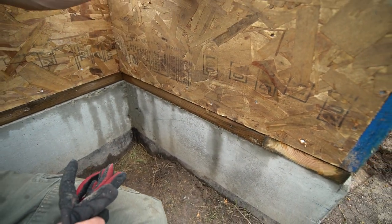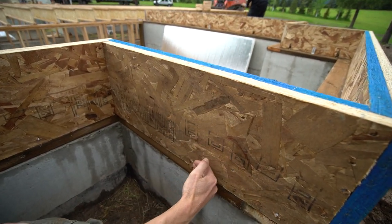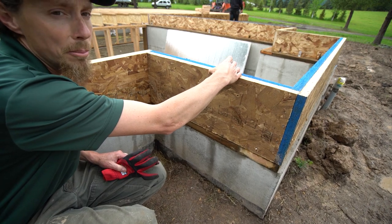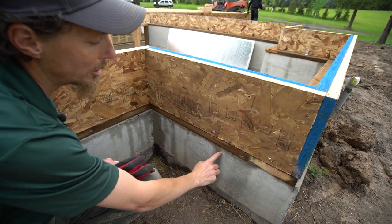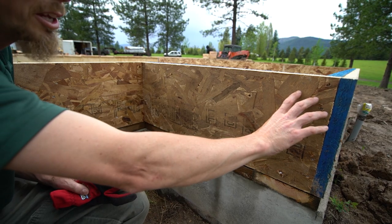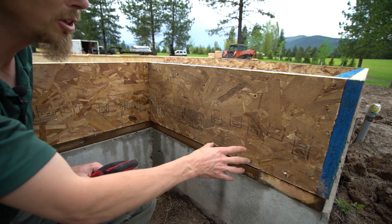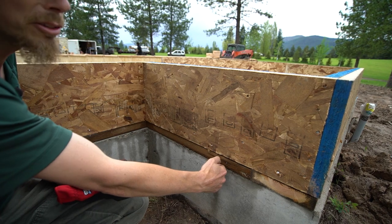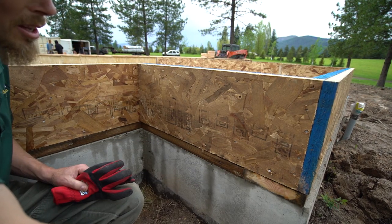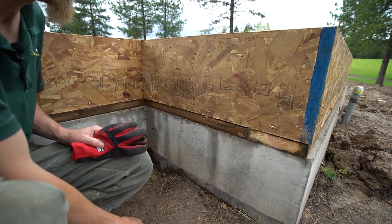What we'll be doing is after our 3/4-inch subfloor is put on here, we're going to put ice and water shield going down the face of this all the way down to here to make sure this is completely waterproof. Then next we have custom metal, about 2.5 inches by 15 inches. That goes all the way down here to make sure that's completely covered with metal. Then on top of that, we put a cedar fascia on the outside, 1x12 cedar, which comes down about here to dress it up. So you have three layers of protection on the outside here. You have the ice and water shield, you have the metal going down the outside to protect it, and then you have the cedar going across the face of that. So it's going to be very well protected, and then they just bring their dirt up to here, or perhaps they want to put rocks on the bottom here. That's also another option.